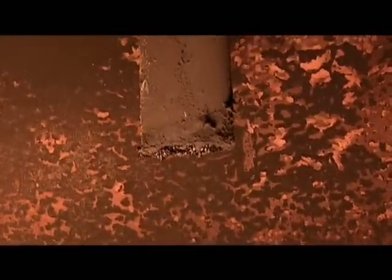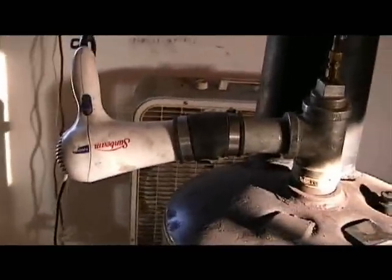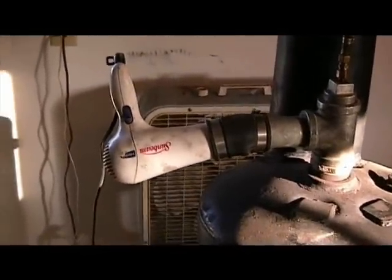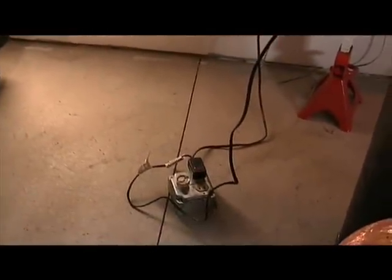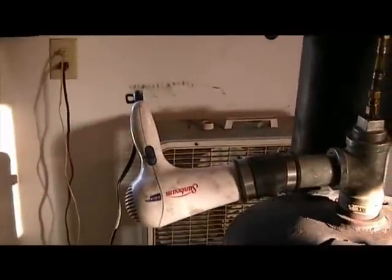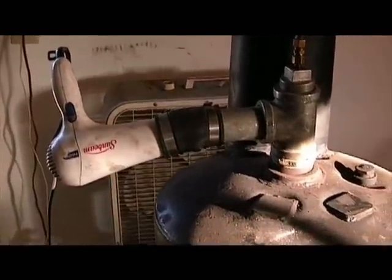Let's see if I can get a look inside the stove here. It comes out inside the stove and inside the burner — the burner is not in here right now. That's where it runs down inside. Now this is also a forced air unit — a forced draft. To create the forced draft I use a hair dryer, kept on high. The hair dryer is attached to a box which has a dimmer switch on it. So being that the hair dryer is on high, I have infinite control of the speed of the fan.